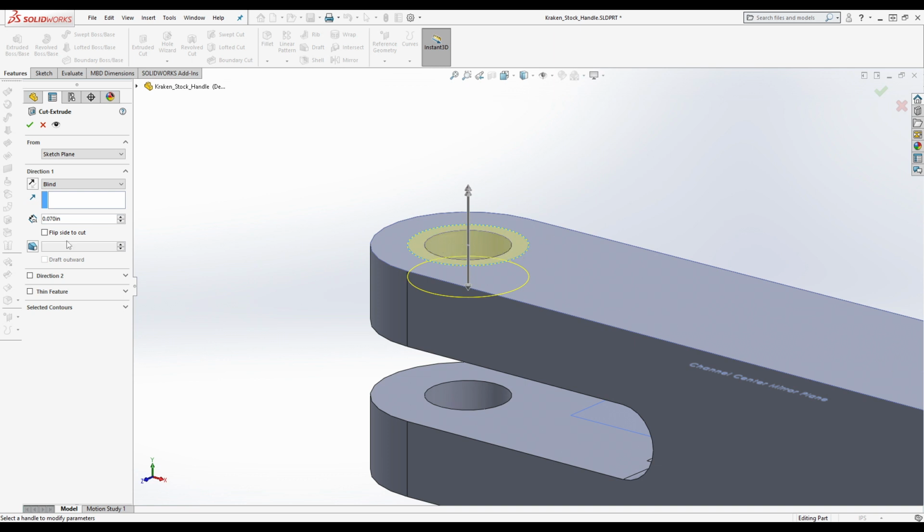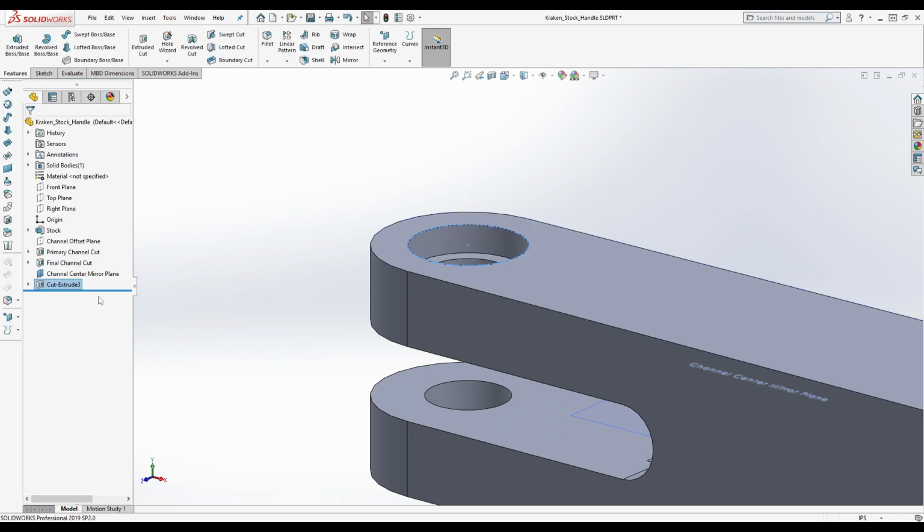It looks like he only milled it in a 16th of an inch, which makes sense because we do have slightly too thick handles. They're 0.505 in some places, probably from the burr, and 0.503 in other places. It would explain why this is measuring a little over a 16th of an inch, which is 0.065. We want to create what he has as a CAD model, so we're going to go 0.065 offset from this surface here. I think that's the incorrect way to do it, but I think that's how he did it.